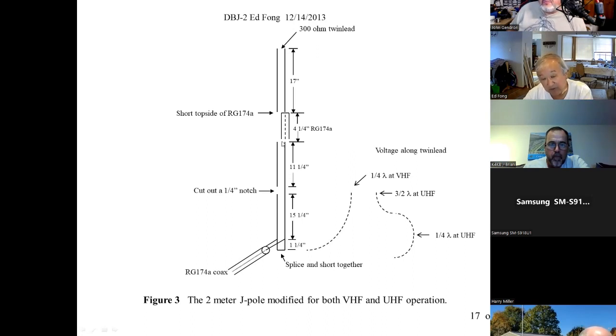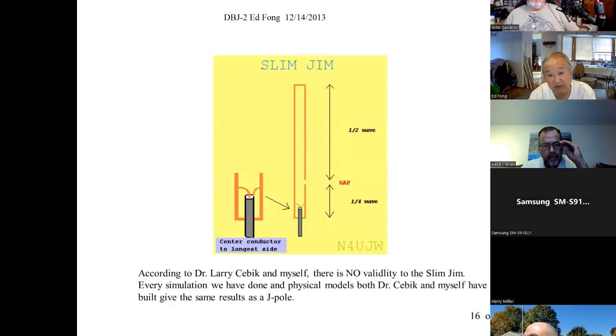Short circuit, infinity. So only at UHF does it see infinity. So you've made a trap, not out of L's and C's, because I tell you, L's and C's are very inconsistent at VHF, UHF. You've done it with coax. Yes, you can do it with coax. So at UHF it stops, but it's not resonant at VHF. At VHF, it goes right through. Therefore, you have a VHF and UHF antenna. That's the trick, or the main topic I'm trying to get across here.